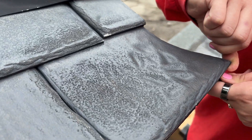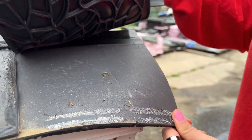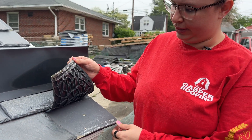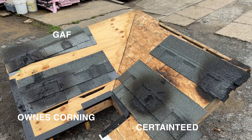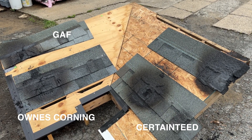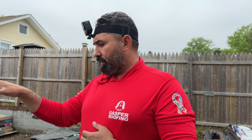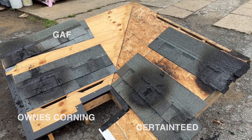It's rubber and it melted — I can't even lift it. Look, it's completely melted onto the next shingle and it's plastic. This one probably melted the most, although asphalt melted pretty good too — they all do. Finally got to do this video. I wasn't surprised by the result. I knew Owens Corning was going to be the better shingle — it melted on the front but didn't transfer the heat toward the bottom layer. CertainTeed is a heavier shingle, which is why it didn't cause damage on the bottom. These are the three manufacturers we install the most: CertainTeed, Owens Corning, and GAF. If you like this type of video, please like, comment, subscribe, and I'll see you on the next one.